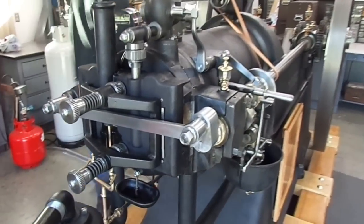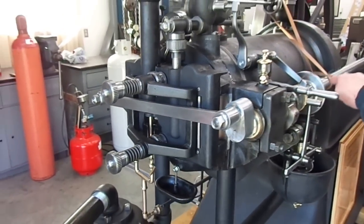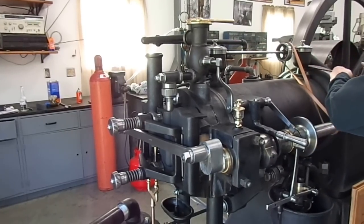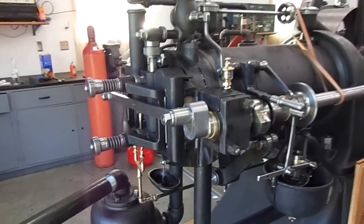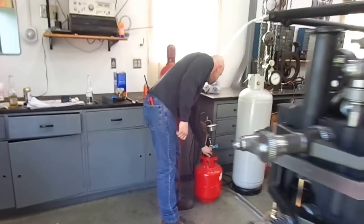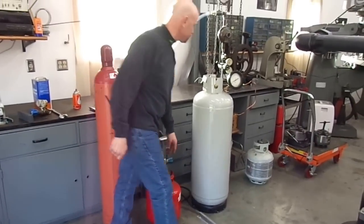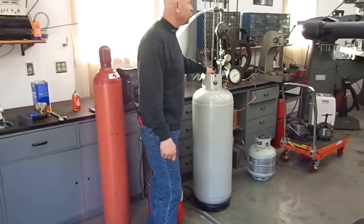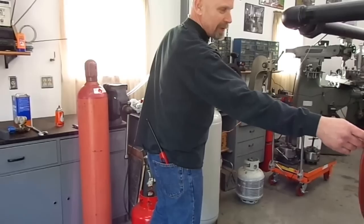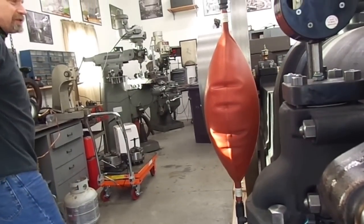Just oiling this. We'll start it up here in a minute. I'm going to turn the gas on for the flame ignition, which is hydrogen. We run that at about one quarter of a pound pressure. And this is a batch of illuminating gas mixed with about 20% methane and 80% hydrogen. You can see the air bag and gas bag inflating right now. That runs at about six to seven inches of water column pressure.